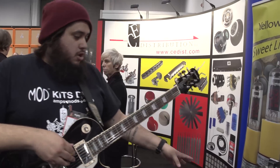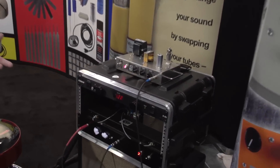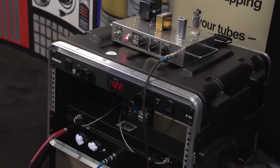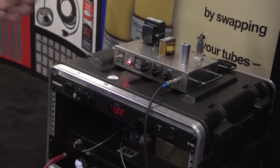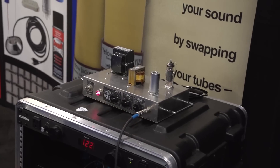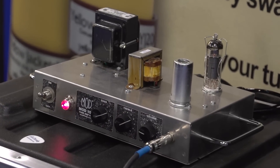It comes with three 12AX7s and a 12AT7. It's rack-mountable — it takes up three U of rack space at the most, that's the peak of it. Or you can have it standalone and put it in front of an amp. Its intended purpose was for recording, so you can actually get a line-level signal out of it. It's got a phono in and two phono outs, so you can do that for tracking.